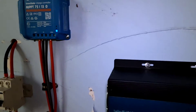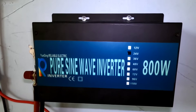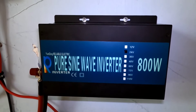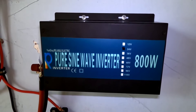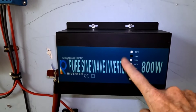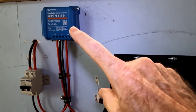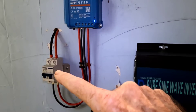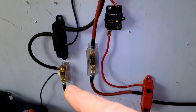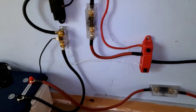The other thing I did is I pulled out the 12 volt 1500 watt pure sine wave inverter and put in a 24 volt 800 watt pure sine wave inverter. We really don't run anything that needs more than 800 watts, so I thought this would be a great introduction to start getting used to higher voltage. I swapped out the inverter and changed that to 24 volts as well. Everything else stayed the same — solar panel disconnect, bus bars, breakers, fuses, battery display monitor, and shunt.